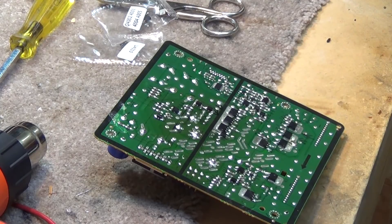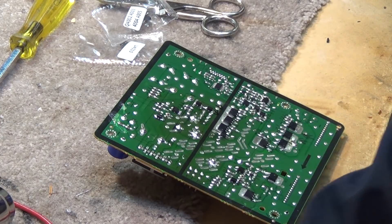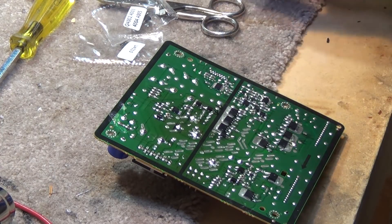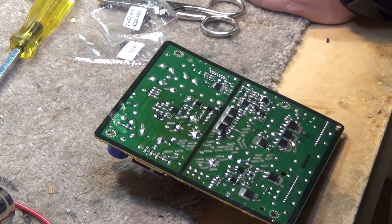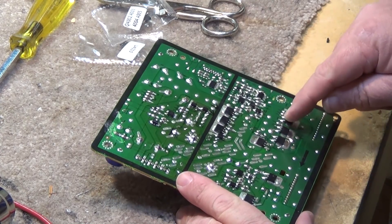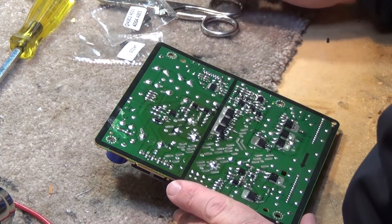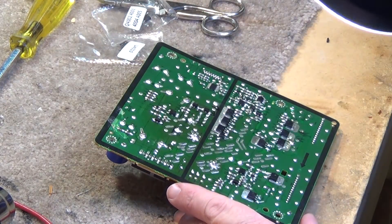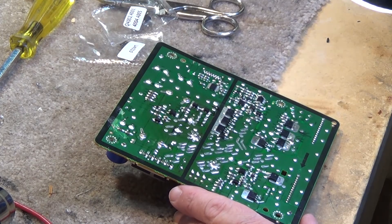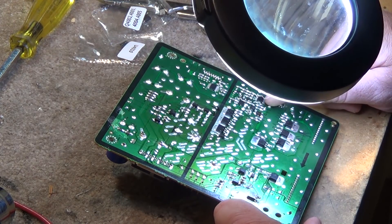The parts kit has arrived. Checking out the parts — it came with an IC and the four IGBT transistors. They're surface-mounted devices, so I'm going to be using a heat gun. I can hear people already screaming 'don't use a heat gun' — but you know what, it works. I'm doing this with tools that most people might have. Not everybody has a hot air station. If you're careful, you can do this with a heat gun.